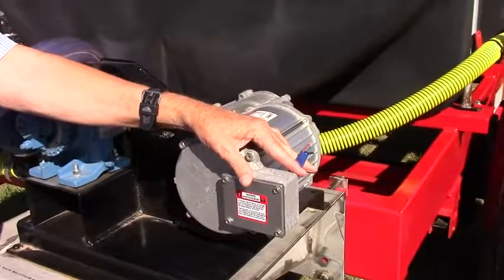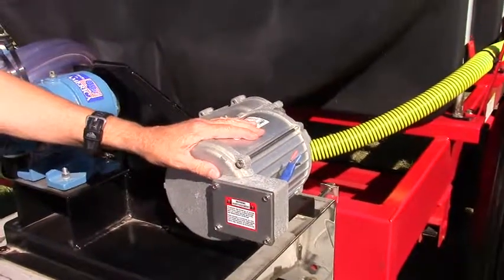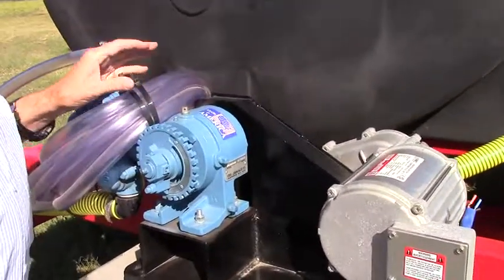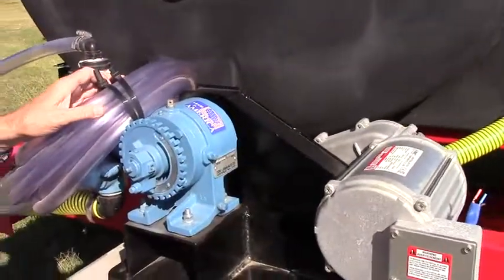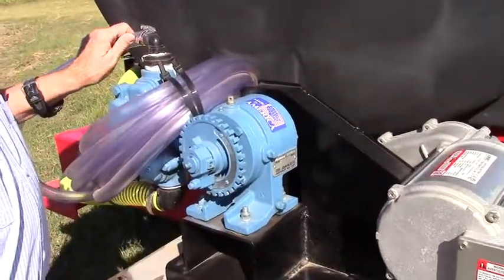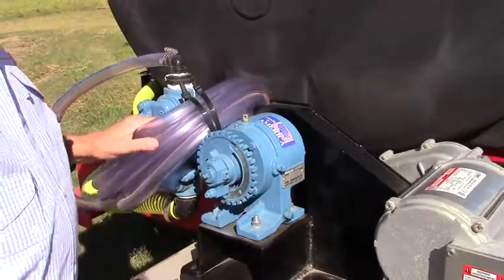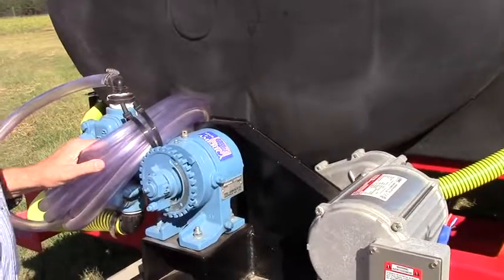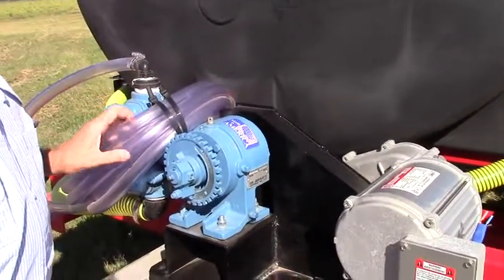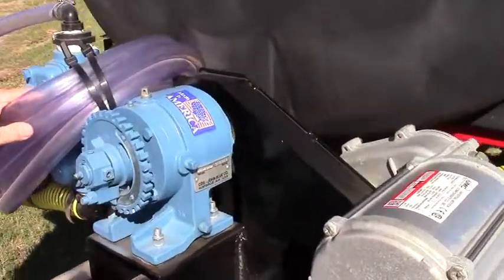You can see that it's run by electric — it can be either single phase or three phase. It can also have a gasoline engine on it if you don't have any electricity. It's real simple. It's got a gear reduction system in it that you set the pump for whatever flow you want, hook it to your irrigation system, and as an option you can have a check valve to put the liquid nitrogen into your irrigation. It is a standard in the industry. It's very simple to use just like all John Blue equipment — you set the dial and it ends up in a rate.